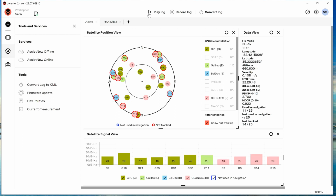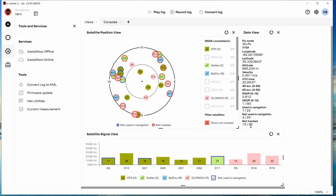So now down to the crux. I cannot find any difference in this GPS and the other two I had before this one came in the door. It's hooking up a bunch of satellites, 25 right now in the basement, but only 9 right now are usable in navigation. And looks like 17 of them aren't. Well, and there's some not tracked. We'll just take those out of the mix.